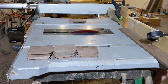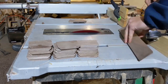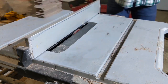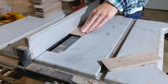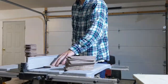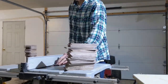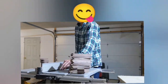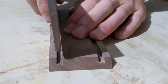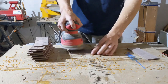After all the 45s were cut, I needed to cut a thin groove in both the tops and the bottoms of all the side pieces, so that the top and bottom could rest in those. This will make sense in a minute. I basically just ran them all through the table saw a bunch of times. And now we see the purpose of the grooves — there is a groove at the top for the top and at the bottom for the bottom, and the fit is very snug indeed.